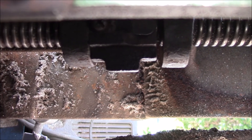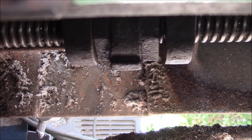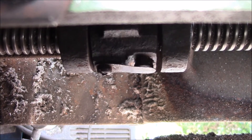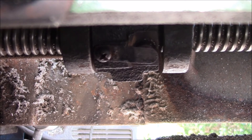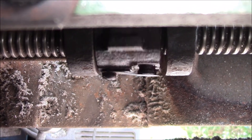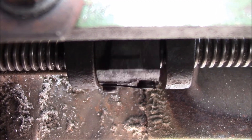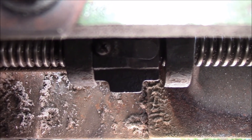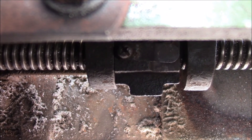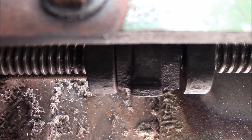I've tightened it up and can't move it. Then as soon as I release the pressure on the screw, watch the center — it drops down and it's loose again. That's quite a neat little mechanism. As I turn the hand wheel there's enough friction to grab the threads and rotate up — you can see the little pin putting a little pressure on there just to engage the threads — then the tab goes up and as soon as it hits that screw it locks up tight. The whole thing just jams in there, cockeyed in that little saddle, and locks itself in place. Then just a quarter turn on the hand wheel and it drops down and releases.